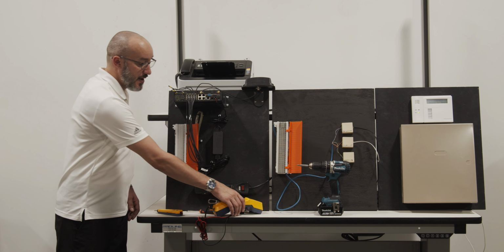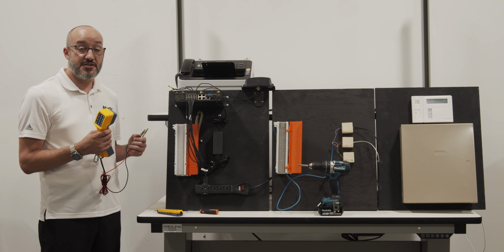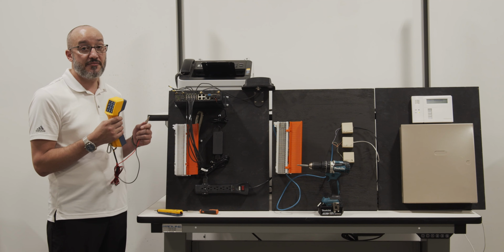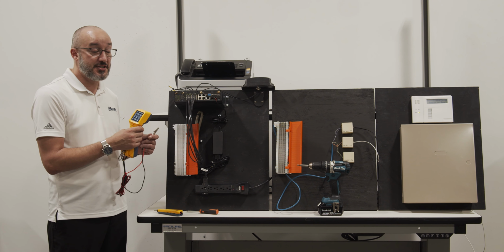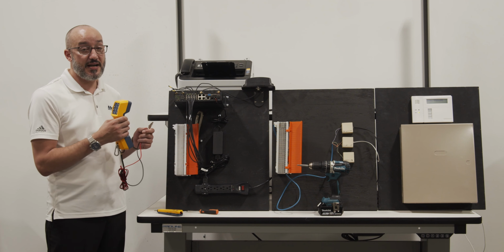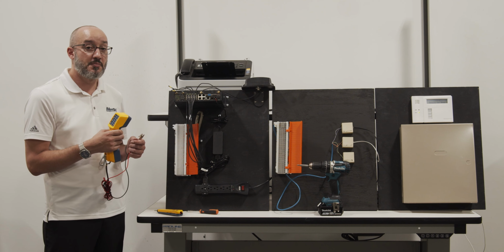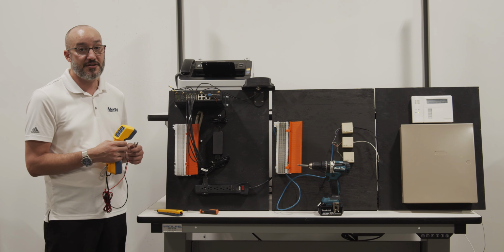At this point, we can go ahead and take our butt set, check for dial tone, and ensure that services are up. In the event that you have alarm connectivity on a given position, you'll make sure that you do not place any voice phone calls, as this will disrupt the provisioning in the CDS 9090 device, and MetTel remote support will have to log in and revert that change.